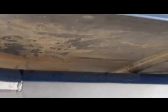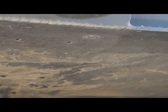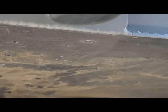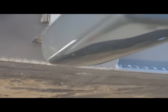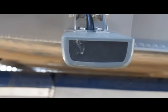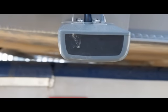The other thing — particularly with plate boats — is you may find small welds or slag left on the bottom of your hull during the building process. These are also things you need to look at when fitting your transducer, because they will throw interference and a bubble trail which will run over the bottom of your transducer and affect your read at speed. So those are the key things to look for when mounting your transducer out of the box.